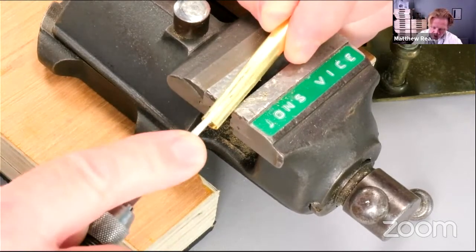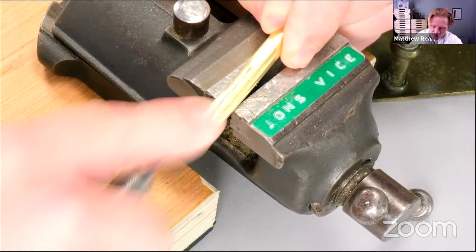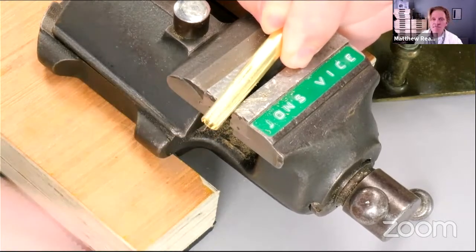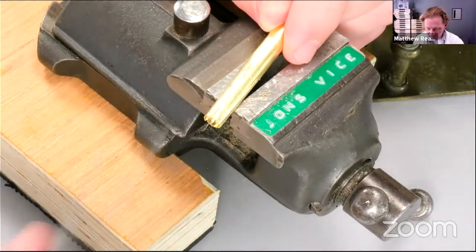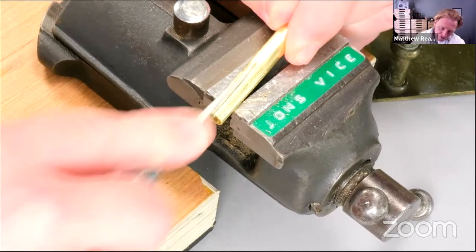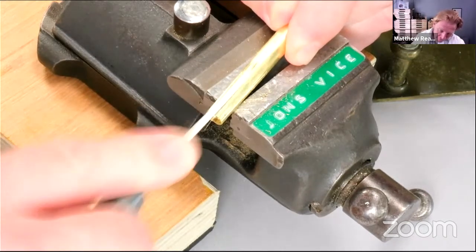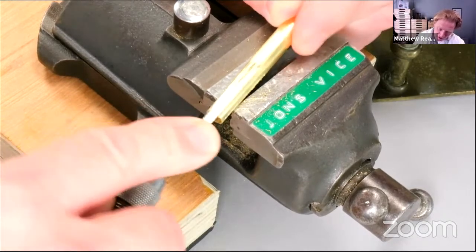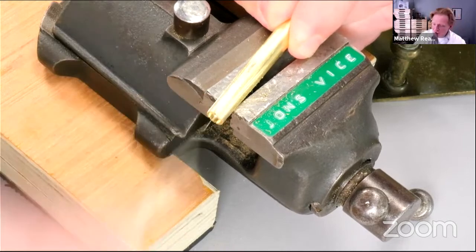So what I'm going to do, not as always, but as often as possible when soft soldering, is to tin both surfaces first. Now, in this case, I'm going to tin this bit of supporting material, and then brush all the solder off. Well, not all of it off, but just leave the thinnest possible layer, which will help the new solder be attracted to it. Not a particularly neat job of that, but cool.